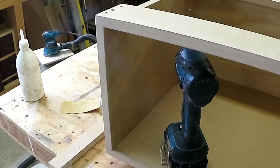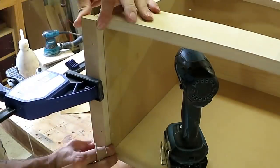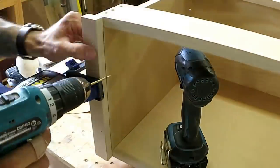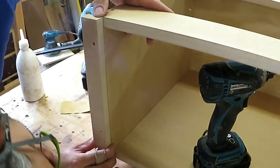To get the cabinet sitting where it has to go easily, we make the cabinet 18mm too short on each side, and then add what we call a scriber to the front. That can be trimmed to suit the wall if necessary.